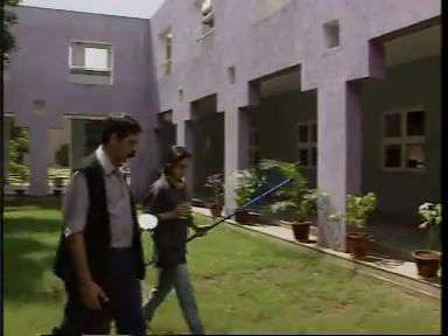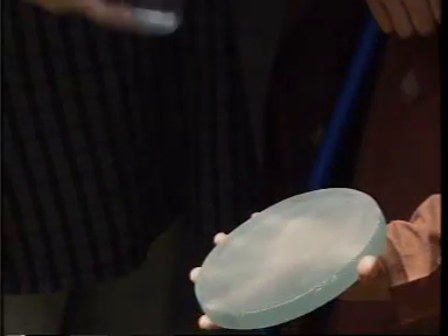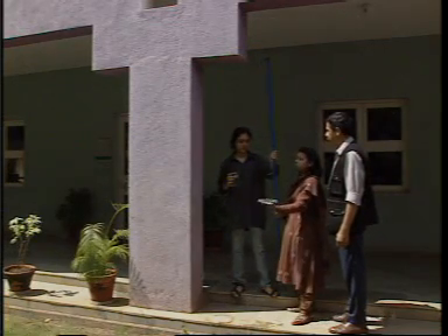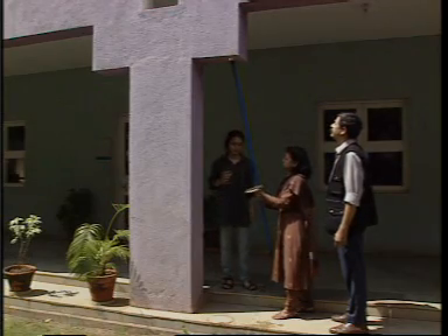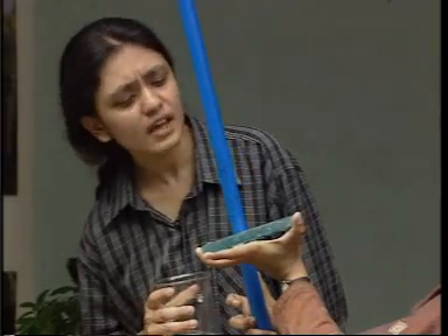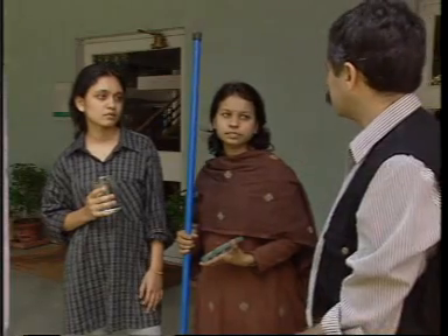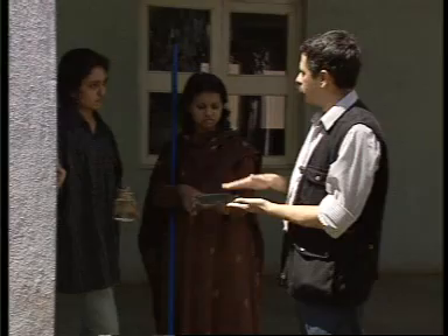After every hour of grinding with 220 grade, it is advisable to check the focal length of the mirror. Wait for the sun to be high up in the sky — this test cannot be done when it is cloudy. Hold your scale in the direction of sunlight, wet the mirror face, and try to focus the sun's image. The distance from the mirror face to the focused image is your focal length. If you overshoot, turn the mirror upside down — keeping the mirror on the bottom and the tool on top — and start grinding again.